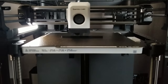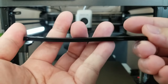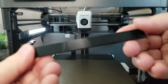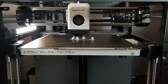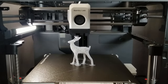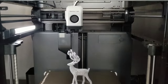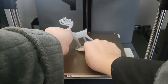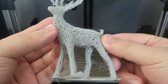Switching to TPU filament, I made a little cover for the frame since the PTFE tube keeps rubbing on it. The print turned out good — all the layers are fused well together. Continuing with another TPU filament, I ran a model that involves a high amount of retraction, making this a stress test for printing TPU. The print successfully finished. We first noticed there is a good amount of stringing. The model itself has an okay surface finish — I would consider it passed the stress test.